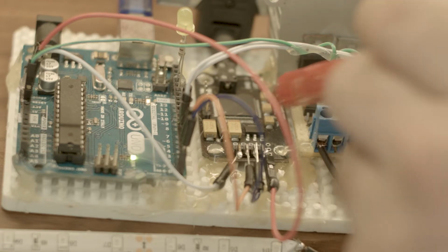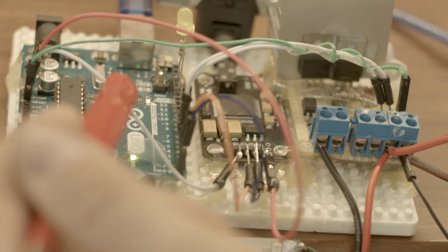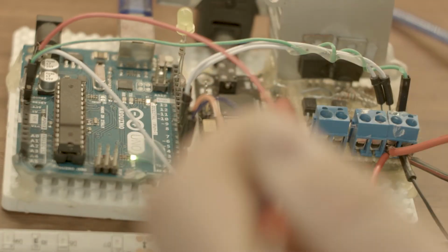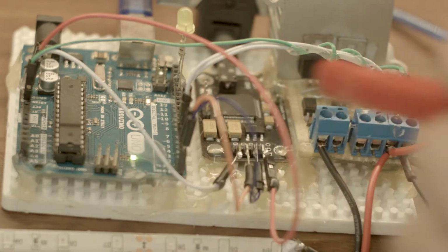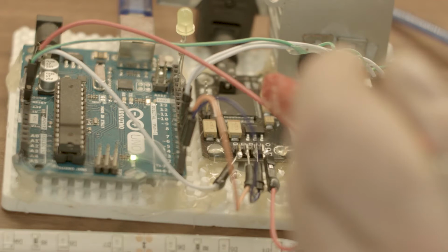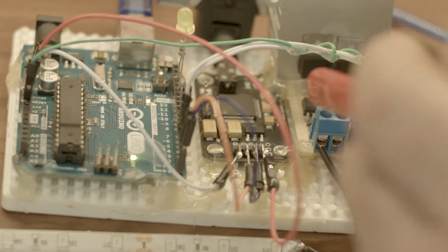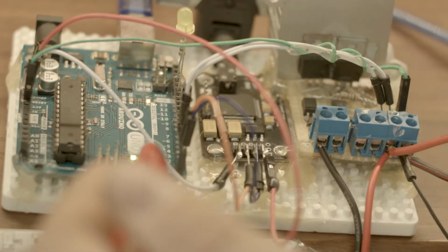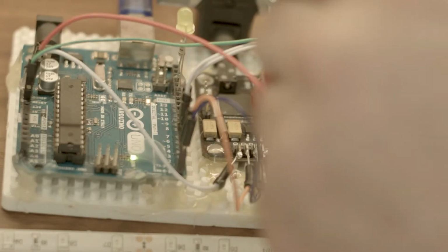To connect your geeetech voice recognition module to your Arduino, you will go with 4 wires: the ground wire, the voltage wire, and 2 data wires, TX and RX. Okay, the TX goes on the RX and the RX goes on the TX. Oh, no, sorry. Yeah, you get it. This TX goes into this RX and this TX goes into this RX.